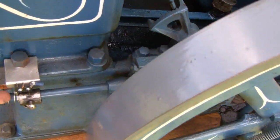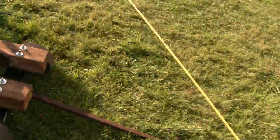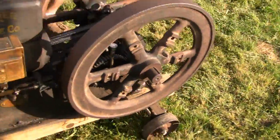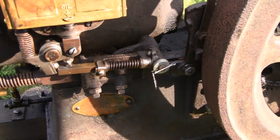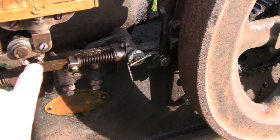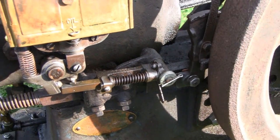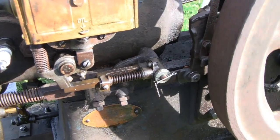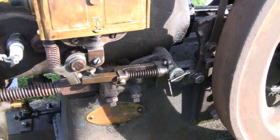This one also has a buzz coil that I have hooked up here. But some of them don't. Let me show you on Mike's engine - he likes mags, which are a little better because you don't need the battery and everything. Then you have this little trigger, and this trigger pushes this. Rotate that. And that trigger right there - that would have been a spark, and that would ignite the spark plug.